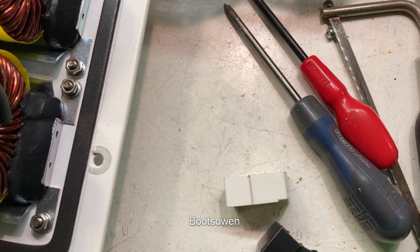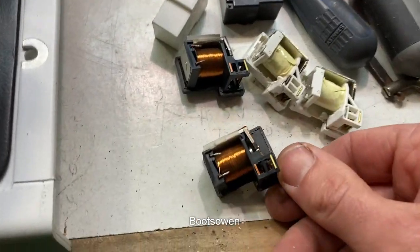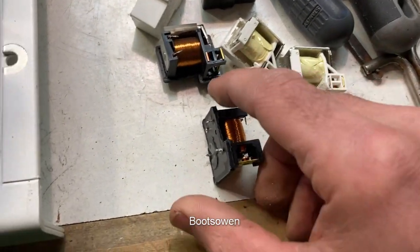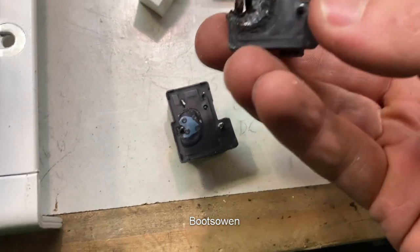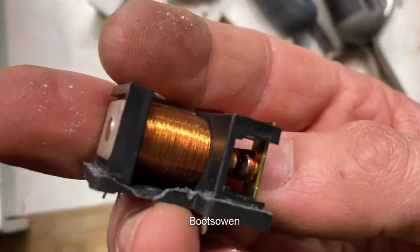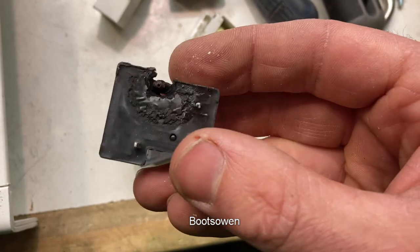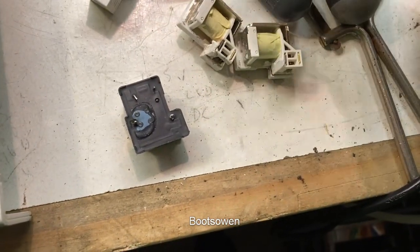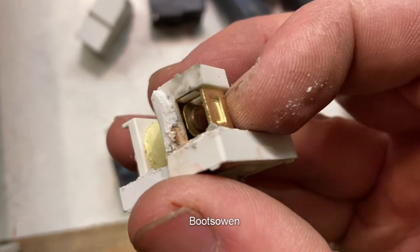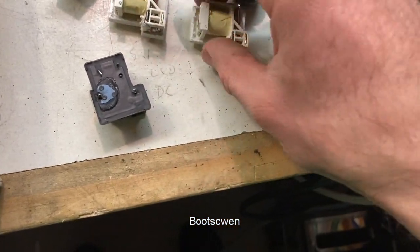All I did was I chopped these open. I'll show you a bad one - if I don't touch the smoothing capacitor. Here's one that has clearly heated up - that shouldn't be like that. There's one that had its plastic melted - not gone on fire, but melted. What's remarkable is the contacts inside still look very clean, so it heated up at the board, probably a bad solder joint. There's another with signs of overheating - the contacts look badly pitted in the center, so I left that one out, although they'd probably still work if you got a good connection.